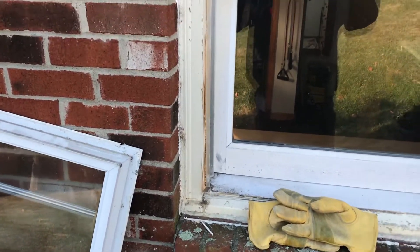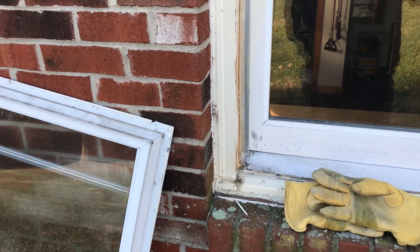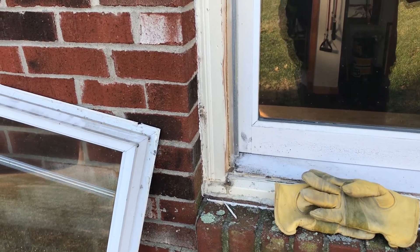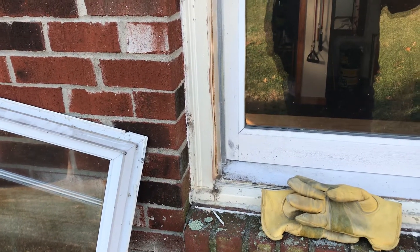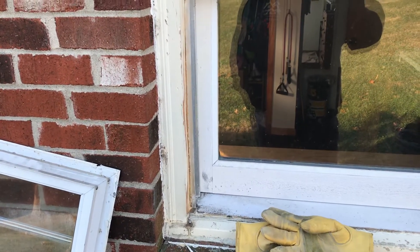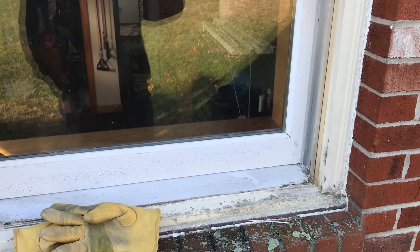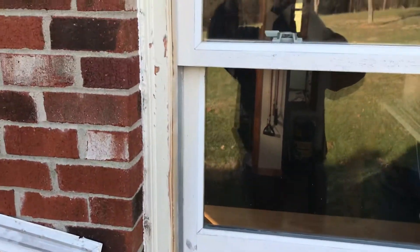This is a video on installing a replacement window, and it's not always as easy as you think. In this situation, the guy before me put these storm windows on using the same caulk I use — and these storm windows were put on 20 years ago. I had tons of blades and was going through about four per window to cut around and get all the old caulking off around the brick and where the metal met the storm window. It was a pretty difficult task.